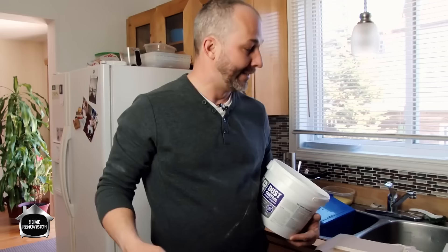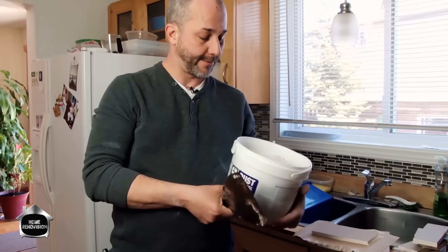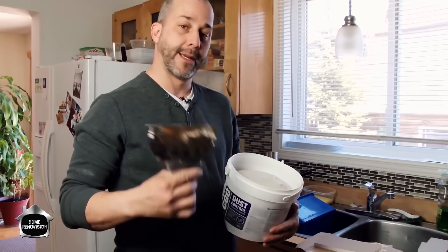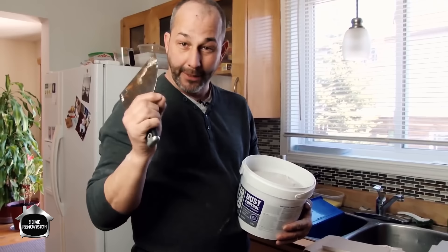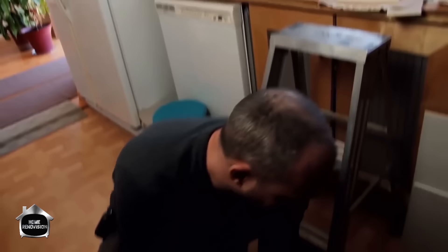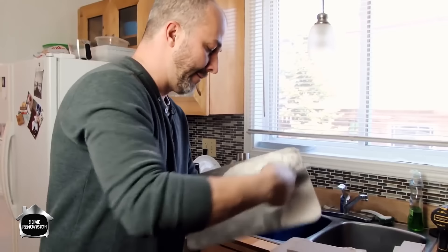For this situation we're working in a finished kitchen, so we're going to use the CGC dust control mud. It's a pretty good product — it doesn't finish quite as smooth as traditional mud, but when you sand, everything falls straight down, making it a lot easier to control the mess. After you prime you can do a little touch-up for any pinholes. It comes pre-mixed — just throw a couple of dollops on your hawk.